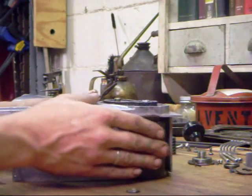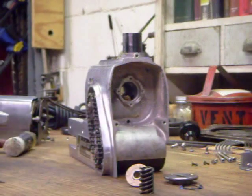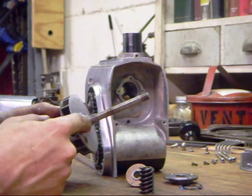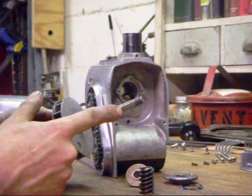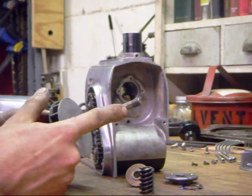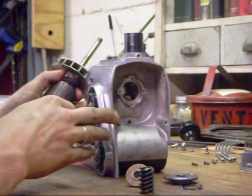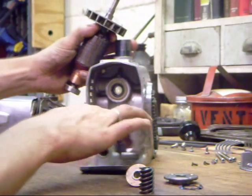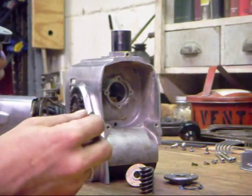Make sure that everything rotates pretty well. The next step is to install our armature. The armature on the 503 also has to support a dust band. How it breaks down is: a seal, a bearing, a slinger, the worm gear, a spacer, a spring washer, a seal and its cover, and then the fan and nut. We've already installed our bearing and its seal in this unit, so we're going to install the slinger and all the other portions when we install the armature.